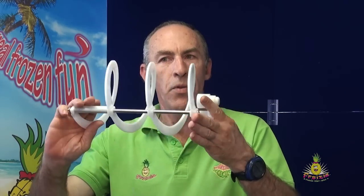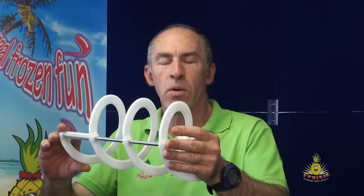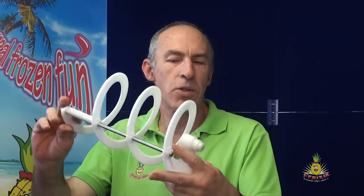If you find that the auger keeps stopping or going like this, it could be that one of the gears in the gearbox is actually about to break, or it is already damaged. And no matter how much we look at this, it's not going to solve the problem.